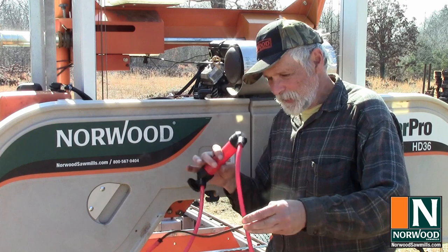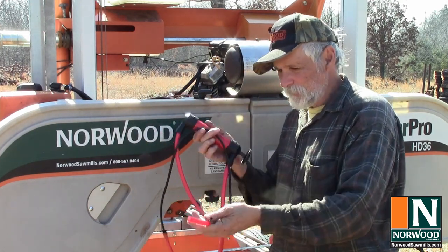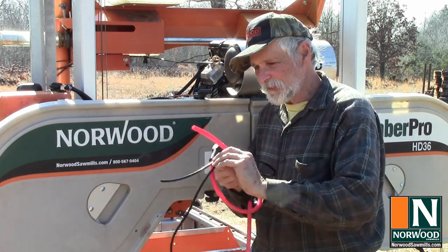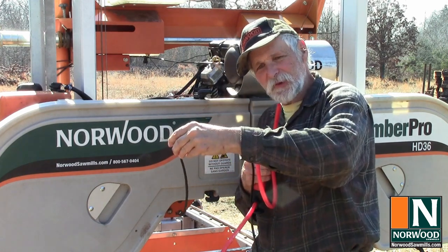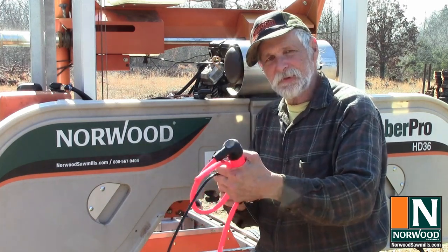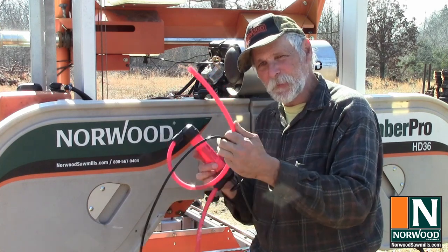I've got this oil suction kit that I bought at the local home and garden shop. And what you're supposed to do is to stick the small tube down the oil dipstick tube and all the way down to the bottom of the crankcase, and then pump it out. And if that works, that'll be well worth the $12 that I spent on this.